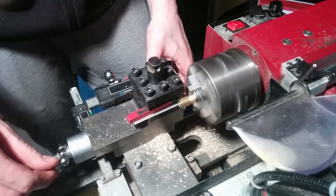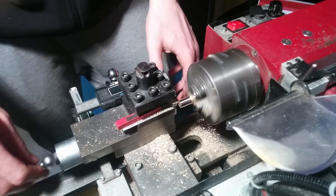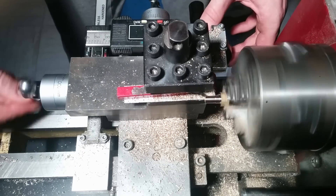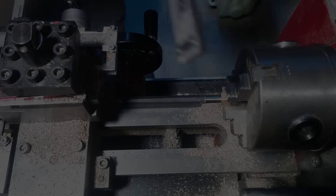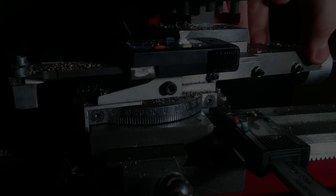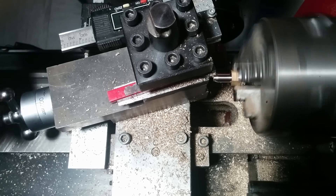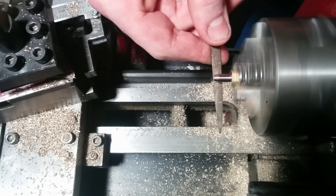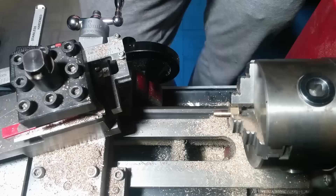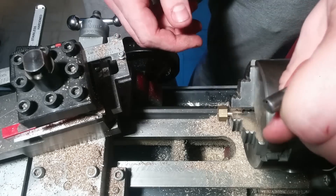Let's narrow down the piece to a diameter of 6mm and make a 15 degrees chamfer for easier thread-making. Then turn the piece around and set your lathe to cut at a 45 degrees chamfer.